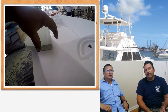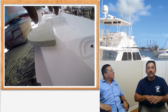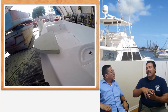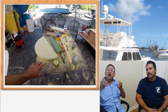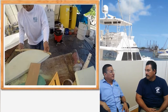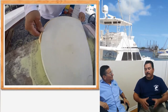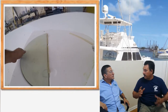Making the plug basically has to be dead-on. Then what we're going to do is set all the hinges, all the dimensions, and then at the end we prime it, tool gel coat it, and put material on the tool gel coat so we make an inverted piece to make the mold. In order to create the hatch, we need to create the plug. It should be symmetrically perfect — the dimensions have to be perfect — and also all the space all the way around the hatches has to be perfect. If it's perfect, when you open the hatches, nothing rubs.